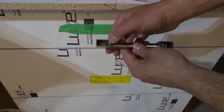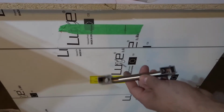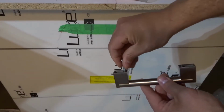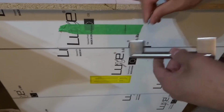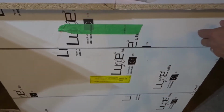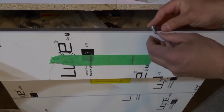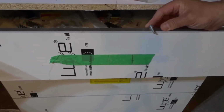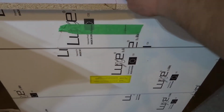So you can see that we have the holes for the screws right there, and I have the hardware to screw these in right over here. So these will actually go into there like that, okay? Now make sure that your screws are slightly deeper than the thickness of the drawer. You can see the screws are slightly deeper than the thickness of the drawer. So that means that I can actually use them to hold the handles in place, okay?